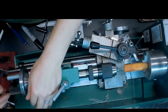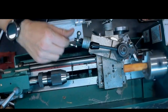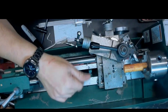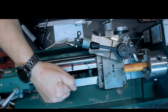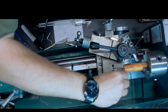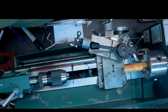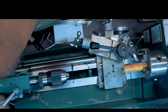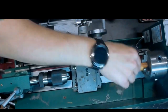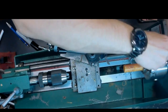And that's far enough in. We're shooting for about an inch. It's not critical because we're going to meet that hole from the other end. Here I'm talking about the fact that you don't want the acrylic to heat up and melt around the drill bit and hold it. So low speeds, I'm cutting around 400 RPM, and tiny, tiny distances of drilling.